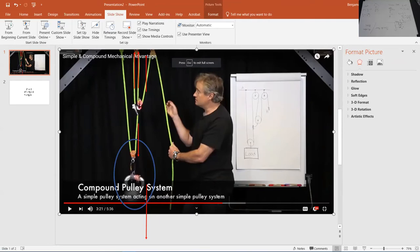You don't need to get good at just seeing that from the diagram. I would just stick with Newton's laws — draw the appropriate bubbles, write F equals MA, it's really not that bad. Of course, if he wants to lift this through one inch, he's going to have to pull the rope through six inches. You pay for a reduced force with an increased distance — you may get away with one sixth of the force, but you'll have to pull through six times the distance. One sixth times six is one. There's no way around the amount of work it takes to lift this thing. Mechanical advantage is not about getting energy free — it's about trading force for distance.